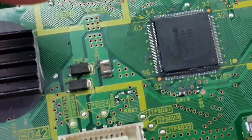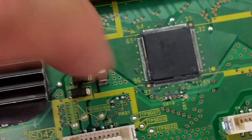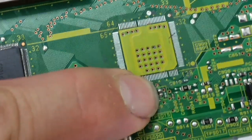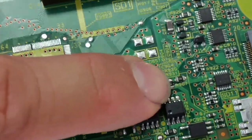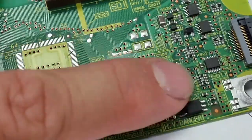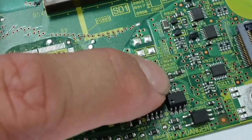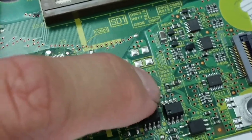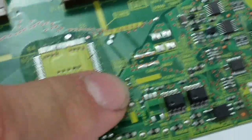So we cut here, we cut here, we narrowed it down to this IC because it stayed up here to this capacitor, and from up there they were nice enough to have those resistors for the rest of the components. So the power goes to those optic drivers and those buffer ICs, but luckily it goes through small resistors of 3 ohms or 10 ohms in this case, and it was easy to remove those and see that the circuits down there are fine. They were not short, and the short was on this main line for power.